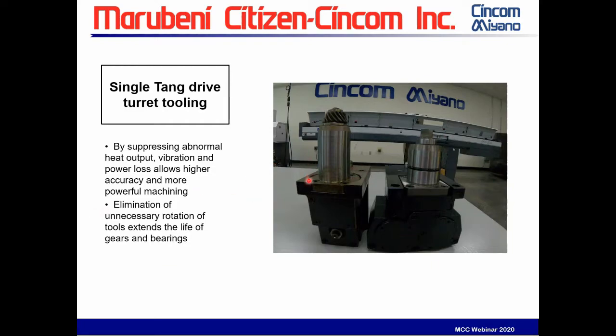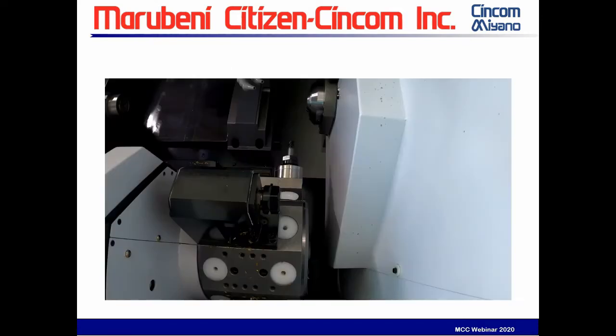It is important to note, though, that if you have an older style M, the live tools in your older style M will not work on the new M. So that is something to be aware of if you have one of the older machines. However, the static tools are interchangeable. So if you've got static tools for an older style M, they will work on this machine.